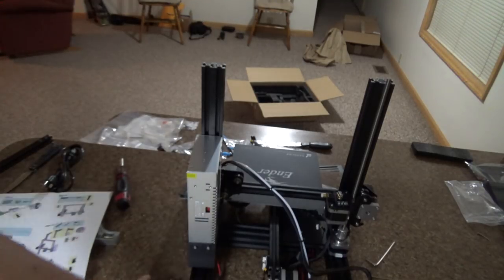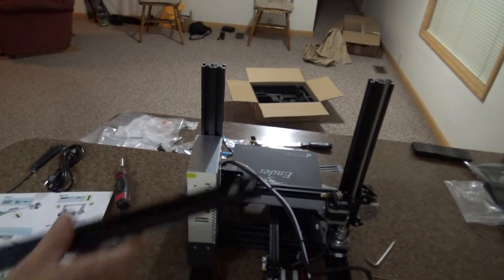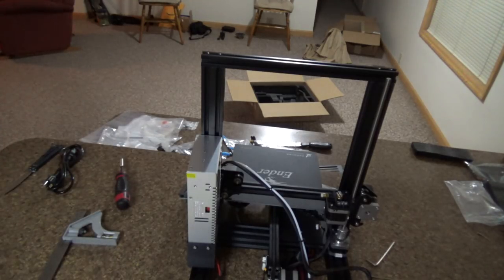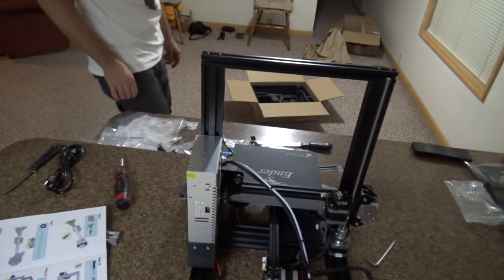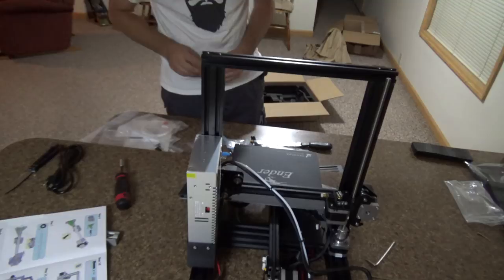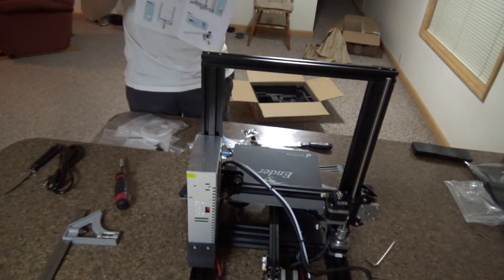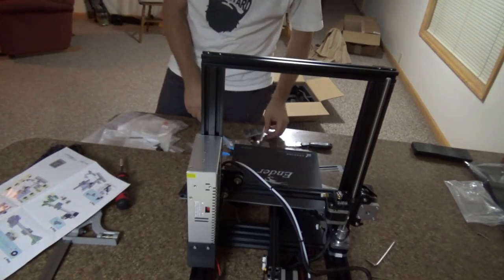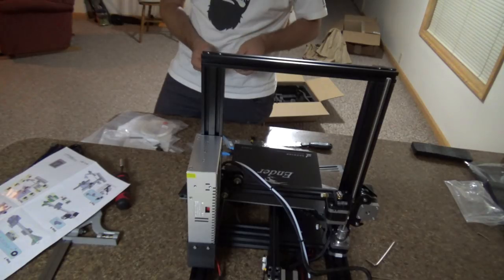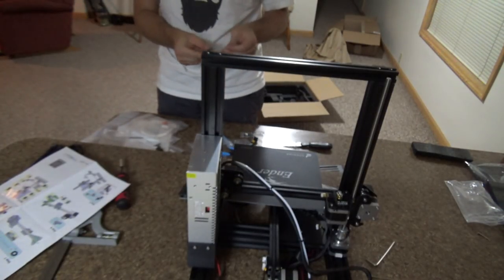The last step is B2, the top bar. So they want you to put the top bar on, and they want you to use 4 M5x25, the washers. And there's some pretty end caps somewhere to put on. It is M5 by 25, I misread. And then profile cover. Oh, and then we need to have these covers.